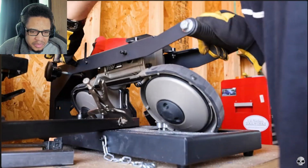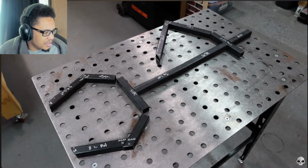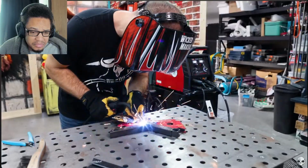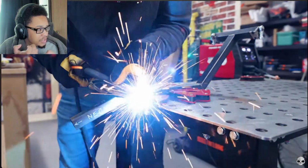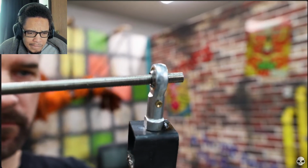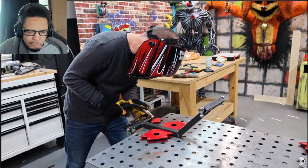Yarnaby's endoskeleton will be made of metal, but basically, we're making the endoskeleton, the head and the fur and the ropes. We also want to add a motor to the body so it gives a lunging attack motion. To make the joints move, we'll attach them to the top of the arms and legs. This allows the shoulders and the hips to move in multiple axes. For the ankles, we'll use straight hinges so it only rotates forward, which is exactly what we want.